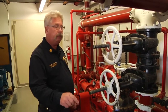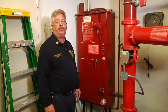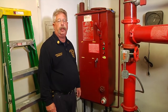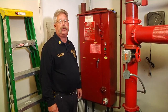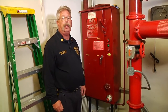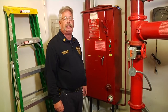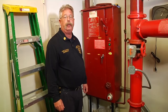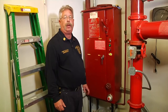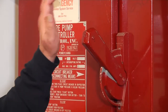Building fire pumps are provided with a fire pump controller. The purpose of the fire pump controller is to start the building fire pump. The fire pump controller senses a drop in pressure — for instance, if there's a fire in progress and two or three sprinkler heads open, the pressure on the discharge side of the fire pump will drop. The fire pump controller will sense that drop in pressure and automatically start the building fire pump. A couple of component parts that firefighters should be aware of on the building fire pump controller: number one is the on/off switch — the on/off switch should always be in the on position.